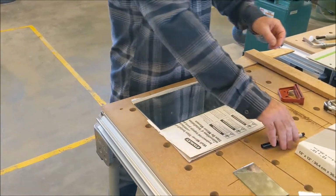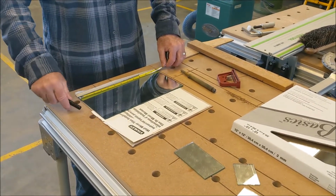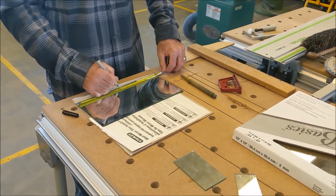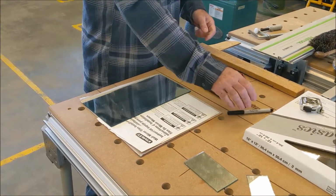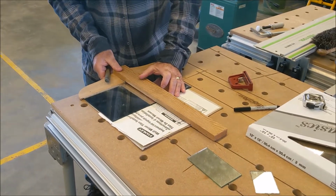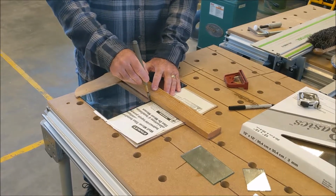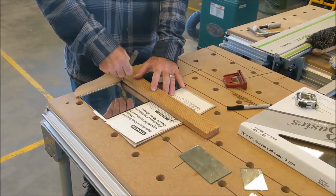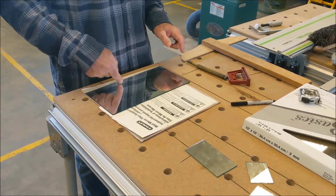The second way, I'm going to come down 6 inches here, mark it, careful not to touch the edges. Same thing, I'm going to scribe it again with my glass cutter, a 3/16 offset. All the way through, so you can listen from start to finish.